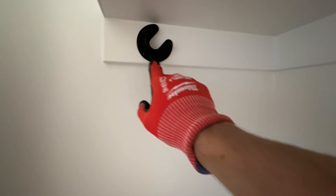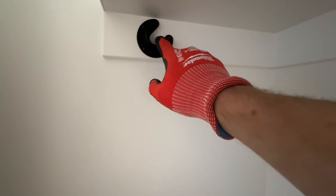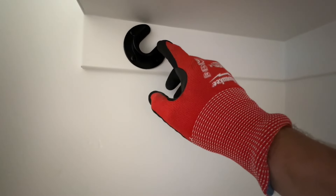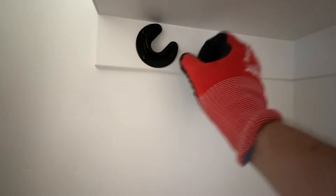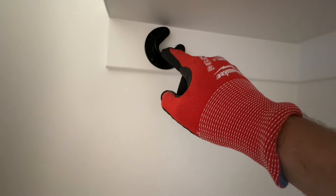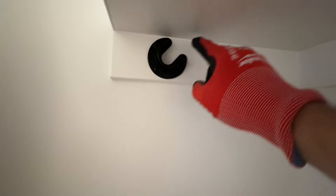It's just three screws, and you see this is the hardest one because it's at an angle. You can't go too much of an angle down because your closet rod will fall out, but you can't do it completely vertical because what you're going to do is you're going to hook the closet rod onto this space. So I kind of canted it up at a bit of a 45 degree angle.